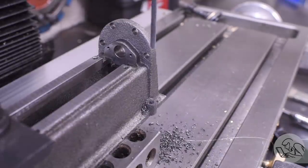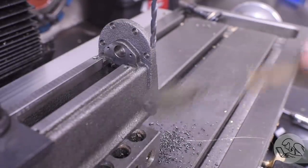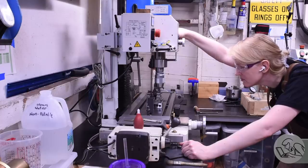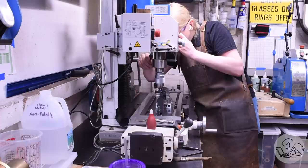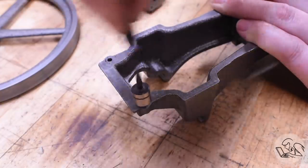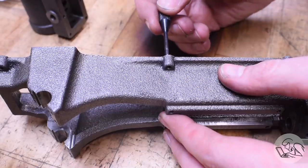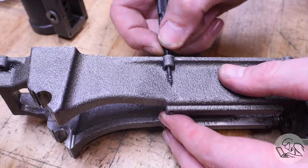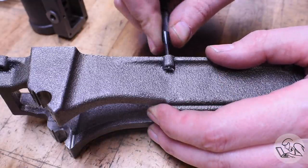They all ended up visually nice looking, even if the bolt pattern that results is not exactly what the drawing says it's supposed to be. This was kind of an interesting exercise in getting around to see what I was doing — a little tricky because I had to eyeball the top of the boss. And then a little deburring — to deburr the tops of those bosses, I went in with my underside deburring tool because there wasn't space to do it from above. I love this tool — there's a link to this down below.